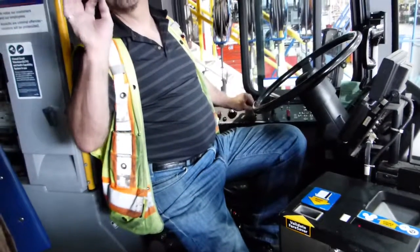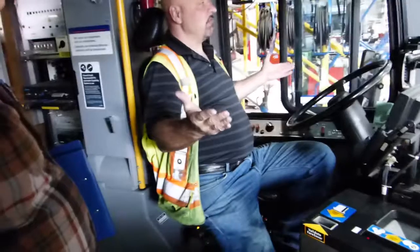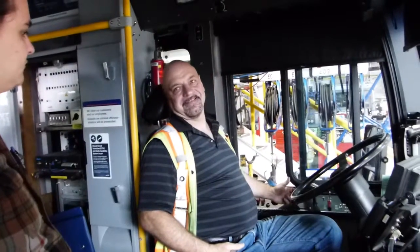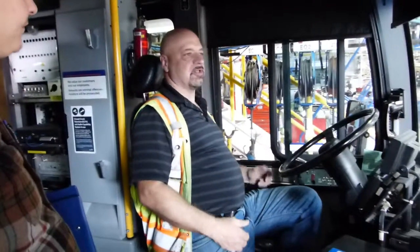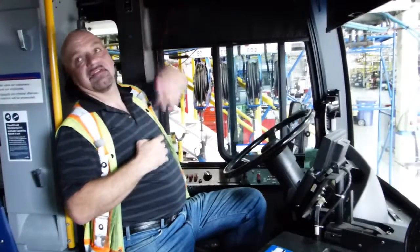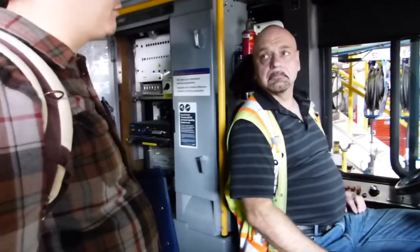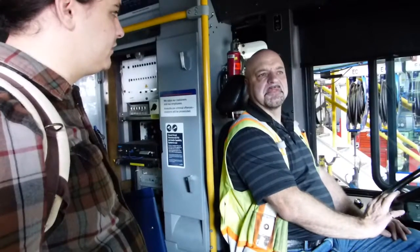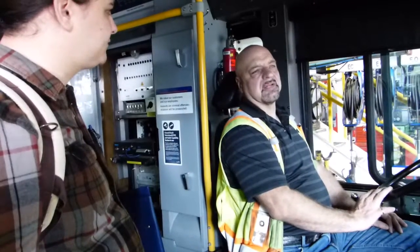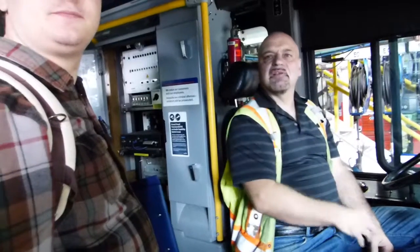It still allows you enough time to drive slowly, because when you totally cut off the power and you're on a slight hill and have to go through the switch, you're not going to have any traction. You cut everything off but you're going to move — so what are you going to do? You'd stall otherwise. So it allows you still 40 amps. We just want to make sure we're a good distance away from the activation current for that switch. Forgetting to pull the switch happens quite a bit. If you don't curve into position properly — too far out or too far in — you have to stop and go out and manually switch it over.